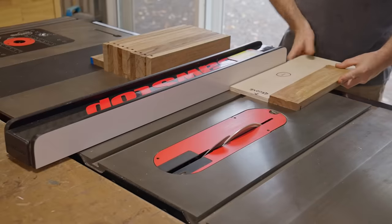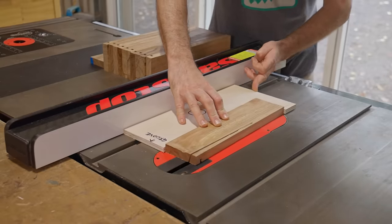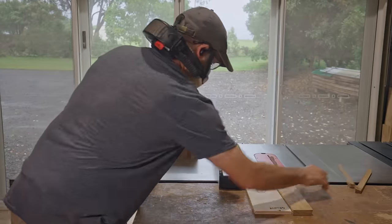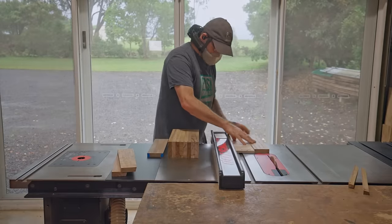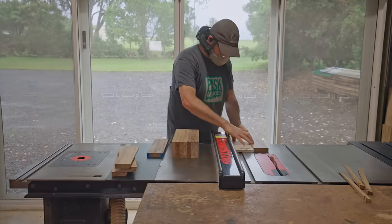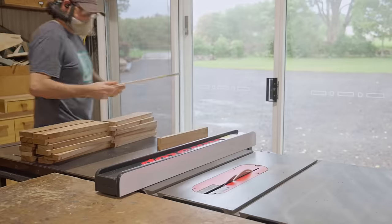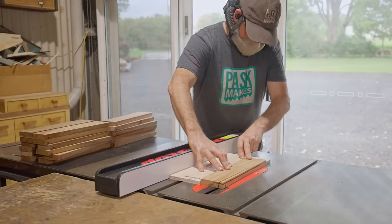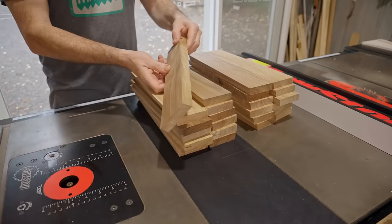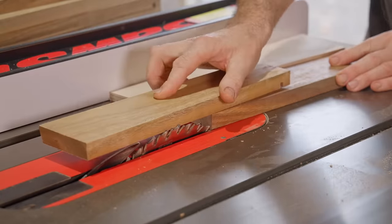It isn't super critical where you cut, as long as the cut goes all the way from the top to bottom. If you cut into the board more than you need to, you'll just end up with a bucket that's smaller in diameter. You could sneak up on the full width by nudging the fence over a touch with each pass until you get a full cut from top to bottom. When you've set up the first board and you're happy, you can go through and cut the rest. That's all of the bevels cut down one edge — I'm spinning the boards around to reduce the chance of mistakes. Next I'll set up jig two.